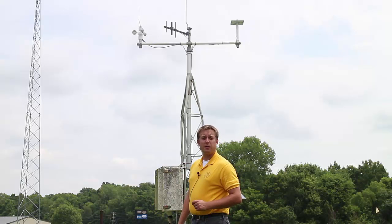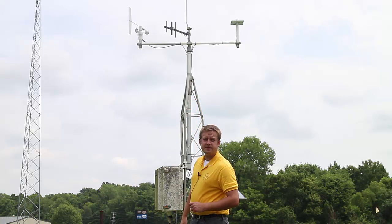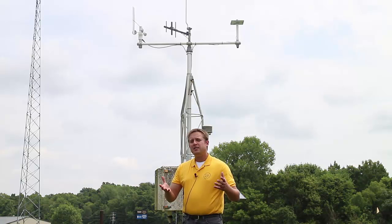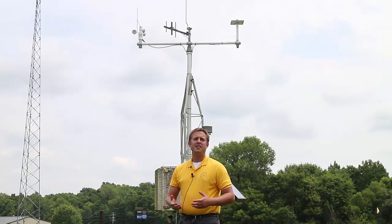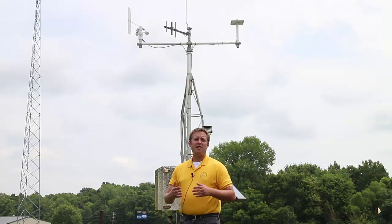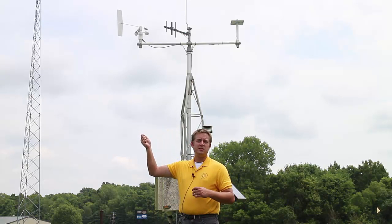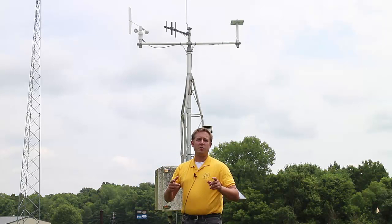If we're going to have a tower type of weather station, we're also going to want a lightning rod that you see in the middle there. That's going to help protect our instruments from the potential for some electrical weather. Now, why choose to have a tower rather than a ground-based sensor system? The answer is fairly simple: if we measure our weather variables at a certain height above the ground, we eliminate the effect of the ground surface on our weather measurements.